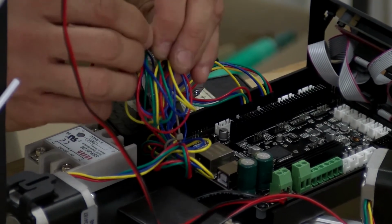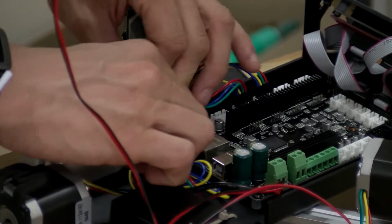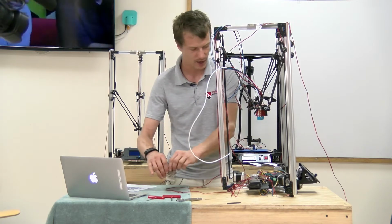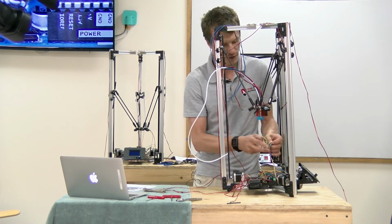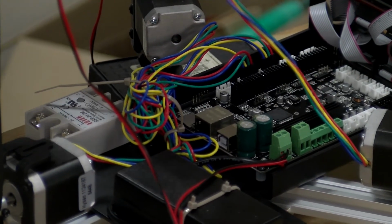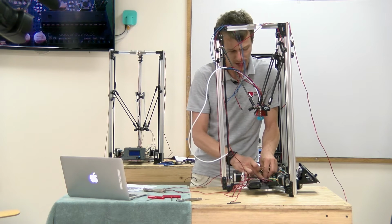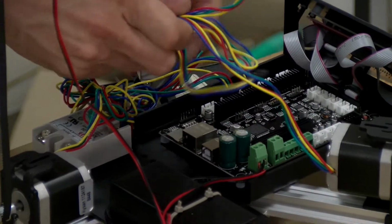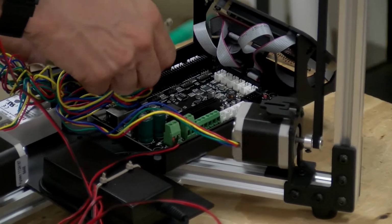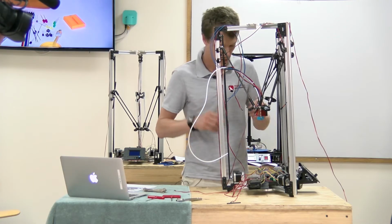As you start plugging stuff in, this can turn into quite a beast, and it's going to be much easier to keep things organized and visually separate for debugging and any kind of troubleshooting you may need to do if it's not just a giant rat's nest of cables shoved in under the build plate. All these extra holes here are for mounting cables to the build tray. So I'm going to just tether things in place temporarily, and then when I know where everything needs to go, I'll wire it down a bit more permanently into those little anchor holes. So there are the motors.